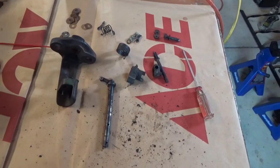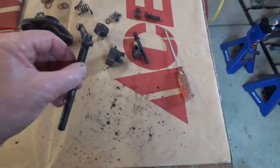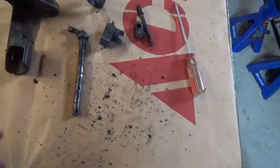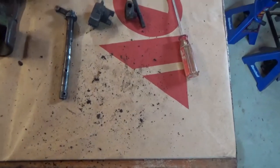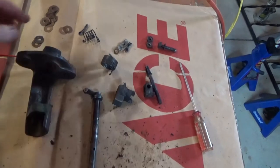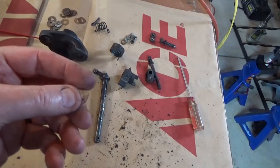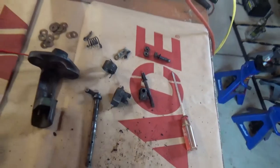I've got the igniter disassembled — it's a lot harder than I thought it was going to be. This particular rotating point is bent, and I like to never got the thing out. I don't know how it could have become bent, but it is, and it'll either have to be replaced or I'm going to have to straighten it, because I don't think it'll ever go back in the way it came out. This igniter uses what's called mica washers — mica being a mineral and an insulator — and I'll need to get a couple dozen of these, because many of the ones that came off are broken, nasty, and rusted.